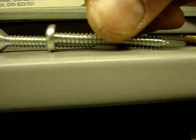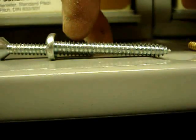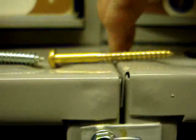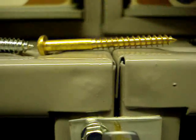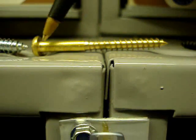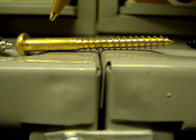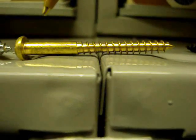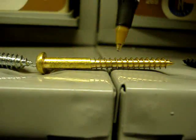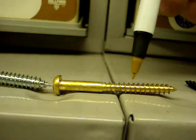Here's another sheet metal screw — threaded all the way up so when you attach it, it can draw right up to the bitter end. A wood screw has threads just in the lower half to lower two-thirds, so this screw is strictly a wood screw and will not do sheet metal at all. Wood screws also tend to be a little softer than sheet metal screws. Sheet metal screws are made of a harder material, so when it's metal against metal, the sheet metal screw will win. When a wood screw goes up against metal, the threads will start to strip out or rip off.